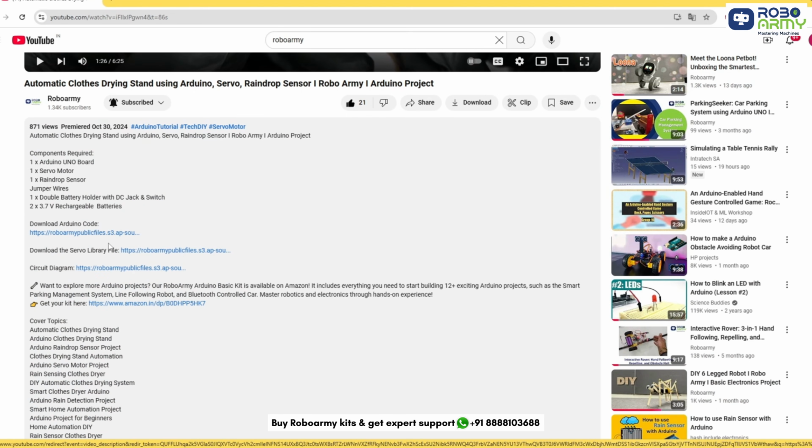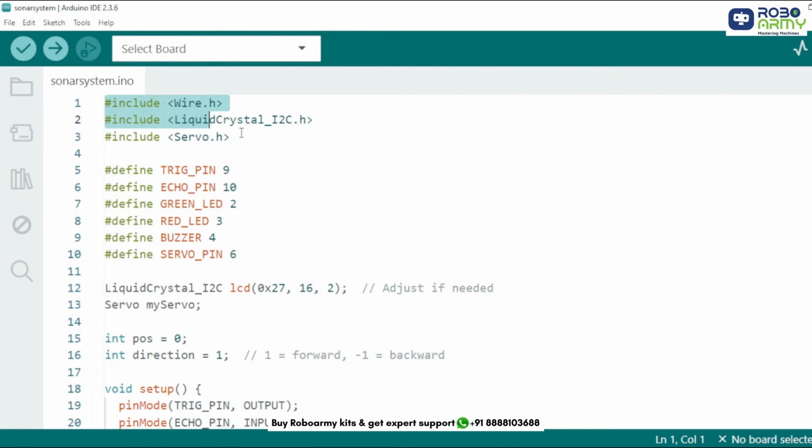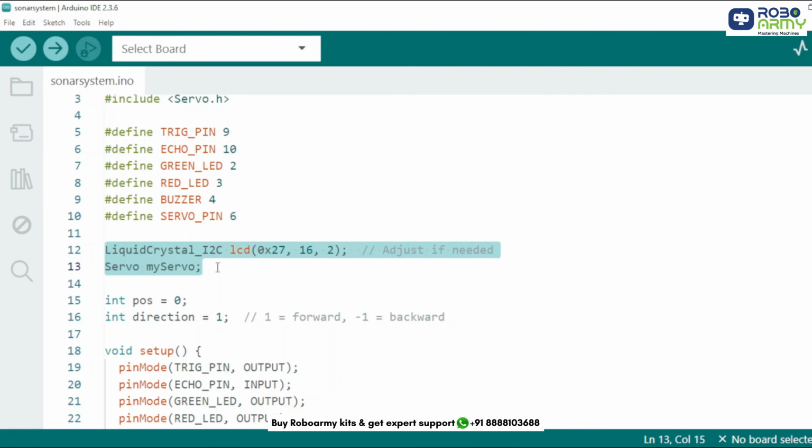Now download the code and library files given in the description below. Open the code file in the Arduino IDE. We will include necessary libraries first. Wire.h enables I2C communication. LiquidCrystal_I2C.h allows us to control a 16x2 LCD display via I2C. Servo.h helps us to control the servo motor. Define pins and components. Pins for ultrasonic sensor, LEDs, buzzer and servo motor are defined for clarity and easy reference. Creates instances for the LCD and servo motor. You can change 0x27 if your LCD has a different I2C address.